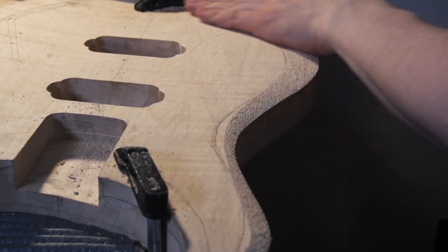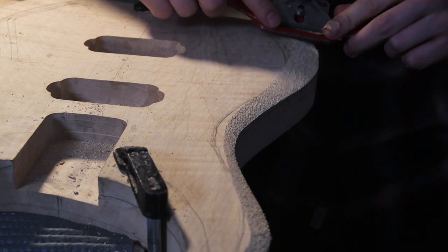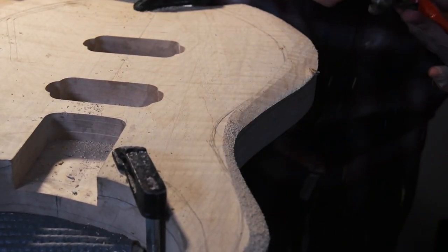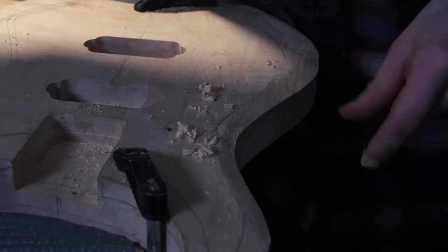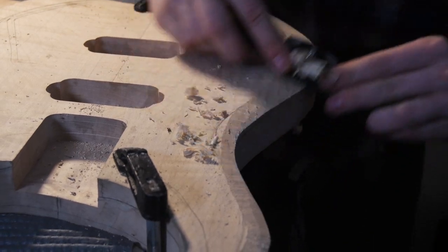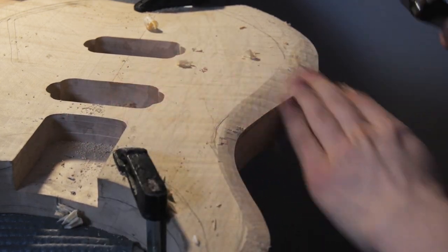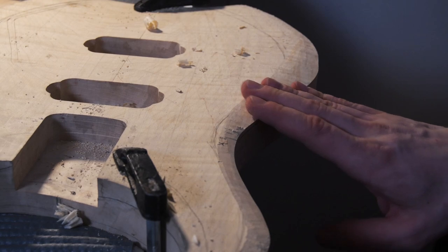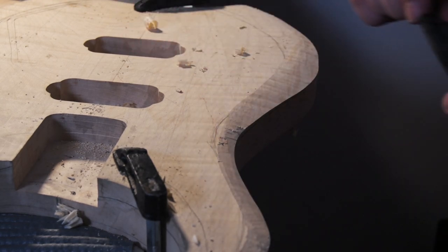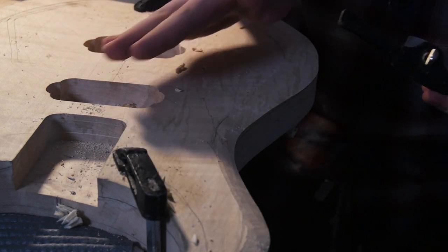Something else you can do to take away more material at first is use a spoke shave. Going over my preferred methods of doing this — spoke shaves are something I use quite a lot just because I kind of like them. That's taking away material pretty quick. The key thing you want to steer away from whenever you're doing stuff like this, especially if you're doing a bevel — a good bevel is one that is completely flat all the way through. With this spoke shave, it has a curved bottom, so I need to be very careful that I don't create a wave on there.